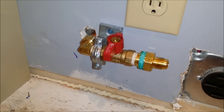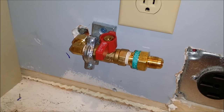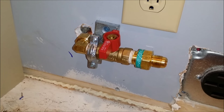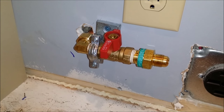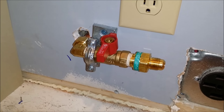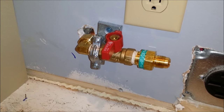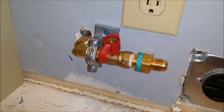Just to show you — there is the valve on the inside. That red valve will shut off the gas, and then there's a connector that will go to the gas stove. I just wanted to add: if you do a task like this, make sure you check with your local regulations. Also, when I got done, I leak-checked everything — I mixed a solution of soapy water and checked the entire system to make sure there are no leaks and that it holds pressure.